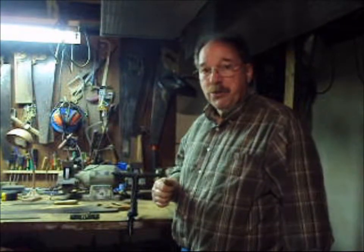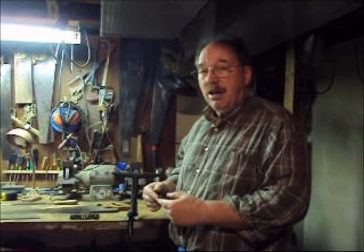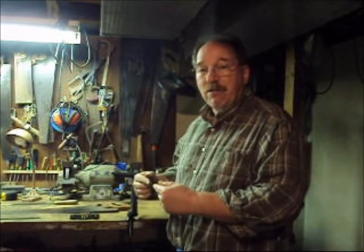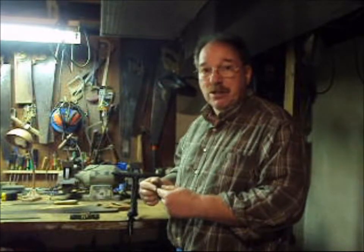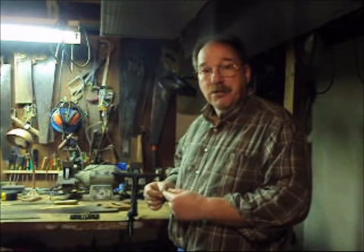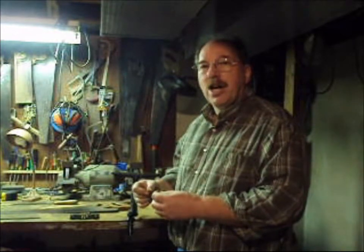We're going to start with a rip saw. Rip saw is the easiest one to sharpen because we don't have to worry about bevel angles and whether it's got enough lead or enough fleam or any of the other buzzwords that you're going to hear about when you talk about saw sharpening. We'll get to those in the next video when we talk about a crosscut saw. But for today, let's talk about a rip saw.